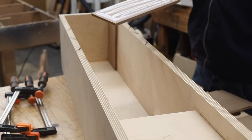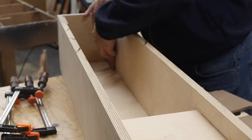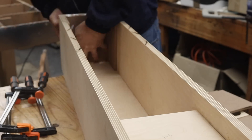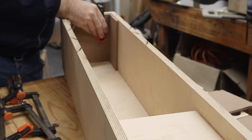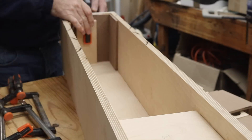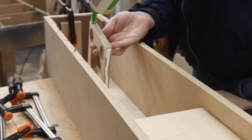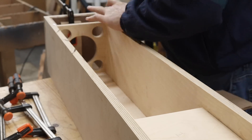As mentioned earlier I am using 6mm or quarter inch MDF to clad the inside of the enclosure, thickening the enclosure walls. Using different types of materials in the construction also helps to dampen the enclosure more, since different materials will resonate at different frequencies and hopefully reduce resonance over a wider frequency range. It also makes the construction a little bit easier.